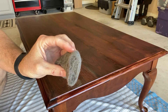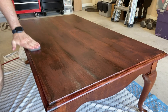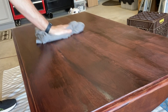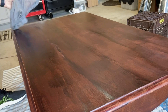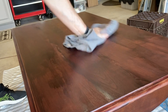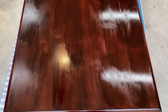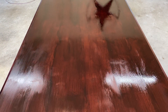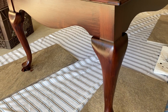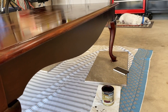Here's what it is - it looks okay but I have some high points and some low points, some shiny points and some matte points. So I took a 000-grade steel wool like the instructions call for and worked on sanding and smoothing it down. It did a pretty good job, but looking at the finish again the coloration shows too many overlaps. So I put another coat of stain on, and after that I tackled the legs and sides - on a pre-finished piece you just lightly sand, apply one coat, and you're done.